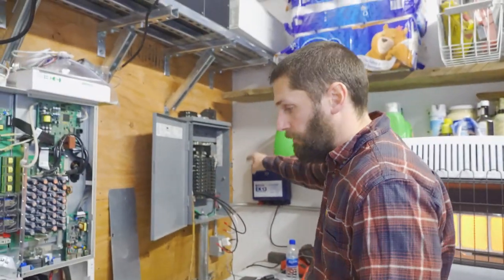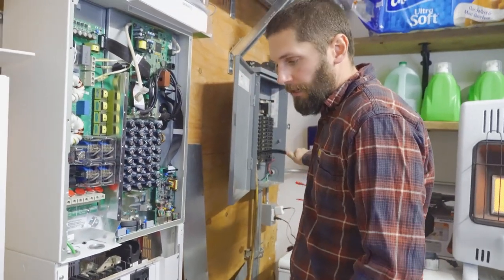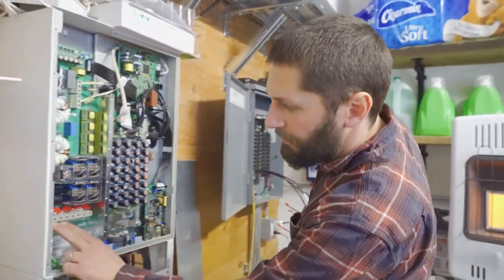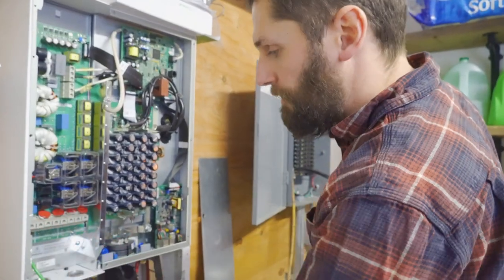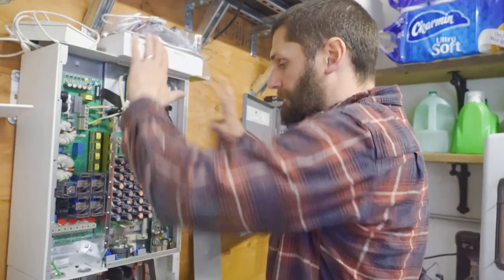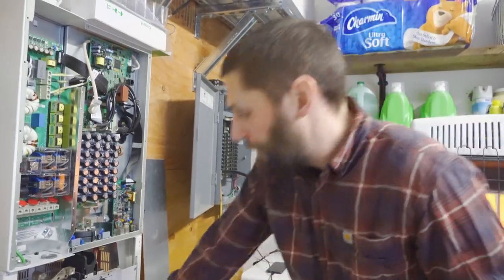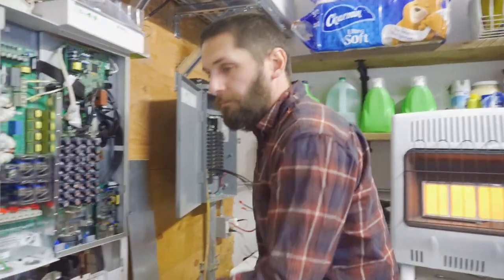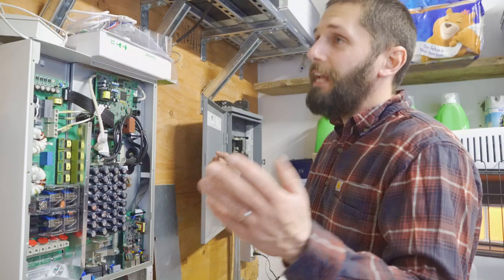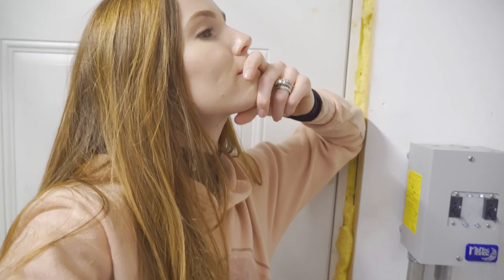We'll connect it, bring the wires up from this panel, tie those guys in, not tie him in yet because we're still on generator, but this stuff can get done. Tie in from our AC load to the breaker, and get it all wired up. Once that's said and done, we can close this guy back up because it's done. And all we gotta do after that is put the battery cables on, run some low voltage through there, and then make some connections, wire a few things up, hit a couple buttons, punch a couple numbers in, and whammo, we got power. What do you think?